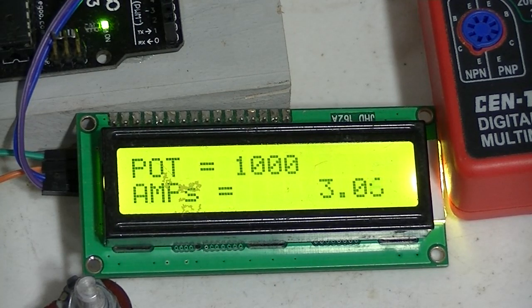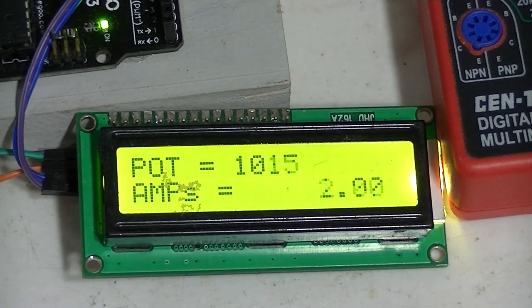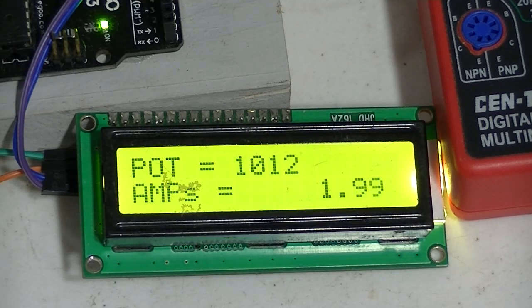Now I'm going to set this for a limit of 2 amps. Now I'm going to take this pot that's connected to the Arduino, which is all the way on, and I'm going to go ahead and control the voltage out based on pulse width modulation. This will read the pulse width modulated high current produced by the constant current source. If you watch the change in the potentiometer, you can see corresponding changes in the output current. Let's pop it up to 2 amps. Remember, I put a limit of 2 amps on it, so if I crank it all the way up, it's going to be 2 amps - that's my limit set by my control on my board.